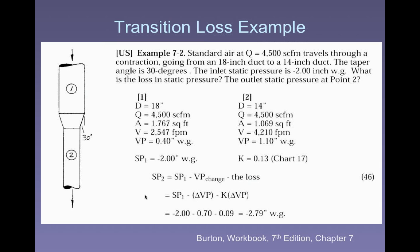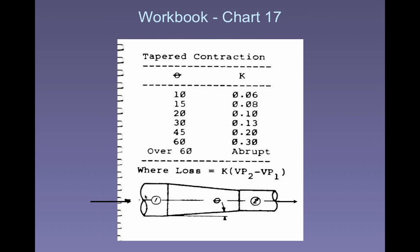Now here's a reminder that in ductwork, you may have changes in the size of the ductwork, and when the size changes, keep in mind the quantity of air is always the same. If you have 4,000 cubic feet per minute coming into the hood, you have 4,000 cubic feet per minute moving through every part of that ductwork. Otherwise you're going to have a vacuum or a lot of air piling up somewhere. As the ductwork gets narrower, it has to move faster. As it gets wider, it moves slower. So Q equals V times A is always a way to figure out the velocity, because the quantity of air has to be constant through the whole system.